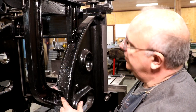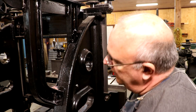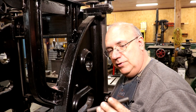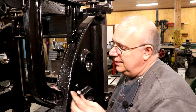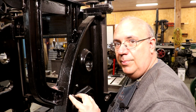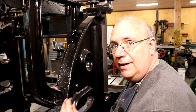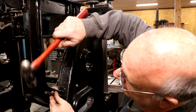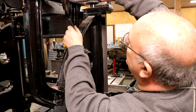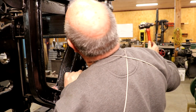When we put this together on these ears, I drilled a hole through here. What I want to do is drill and tap a hole through the casting to put an additional bolt in — I think this is going to give us some more stability. To get these holes lined up, I'm going to use a transfer punch. I've got a set in fractional units from an eighth of an inch up to one inch. It fits the hole perfectly and has a center punch in the end, transferring the center to a punch mark I can come back and drill and tap. I got a good center punch mark there — that felt pretty solid.